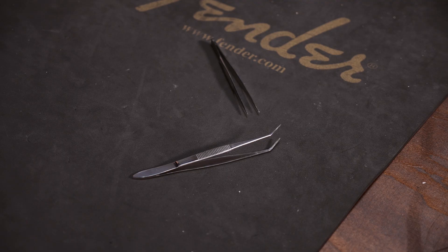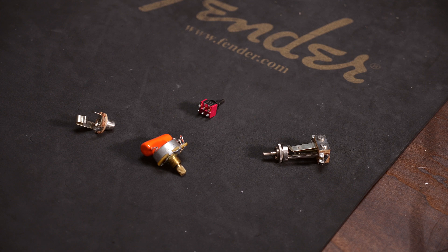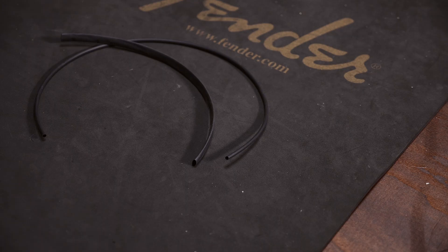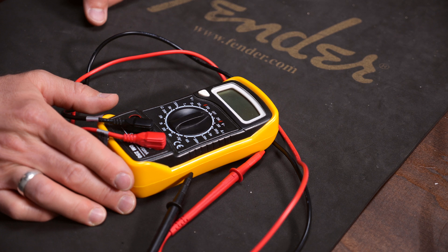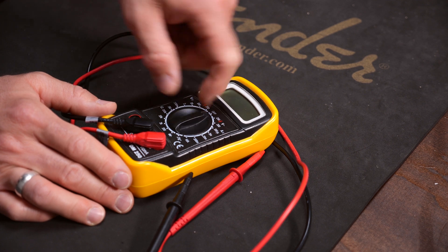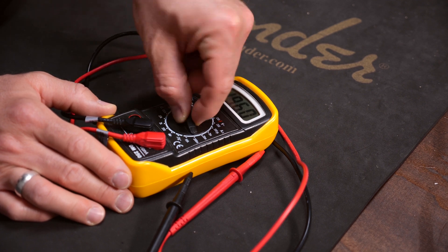A tweezer is useful — it can get really hot and there's not a lot of space in electronic cavities. Other electronic parts like pots, switches, and jack depending on what you need to replace. A helping hand is useful since you often need more than just your two hands when soldering. Shrink tube helps a lot to isolate wires — if a ground wire touches a hot wire or a lug, your guitar's signal will be muted or you'll have some nasty ground hum. And last but not least, a multimeter — if you want to find the issue with the wiring, it's useful to have a multimeter with a continuity testing function. Check out our video on that subject, linked in the description box.